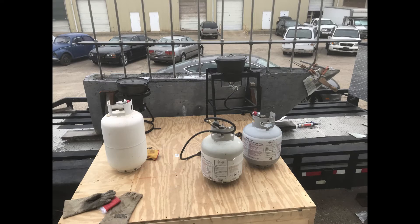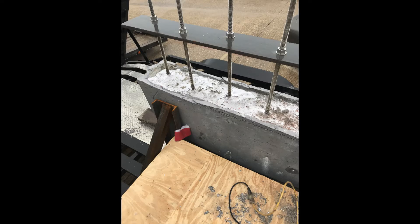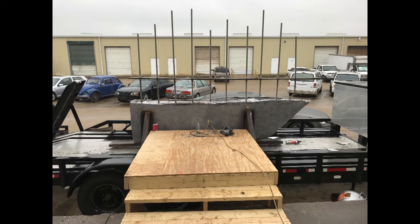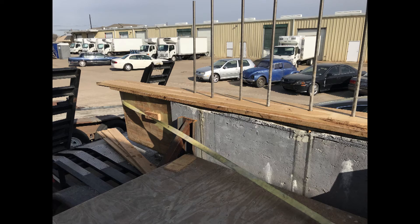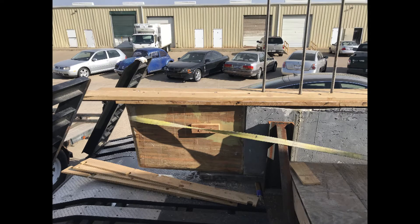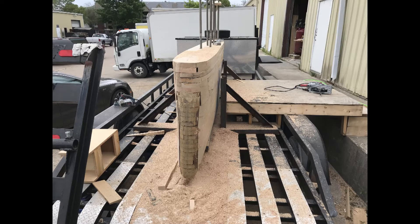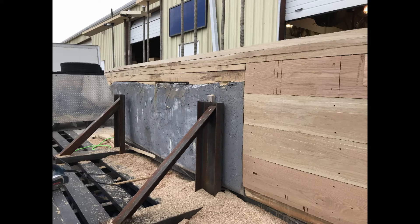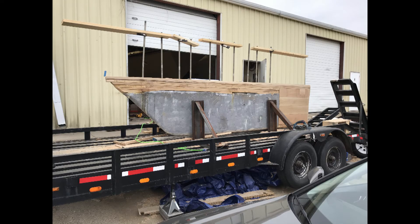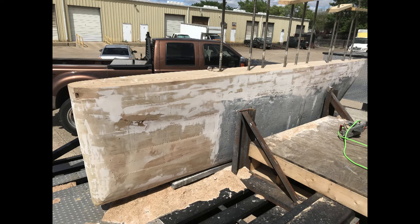I need the weight — I'm going to have 13,000 pounds. There's the propane and the cast iron pots I used to melt the lead. You see it poured back in there. Then I'll start adding wood because I've got to add nine inches on top of that lead. I put nine inches of white oak on top. You see the back of the keel — the wood keel portion is not ballast, that's just wood, but it matches the keel on the boat. So I had to make it longer. That's part of the pattern I made 18 years ago, now going on the back of the ballast keel, bolted on and glued with epoxy and fiberglass.